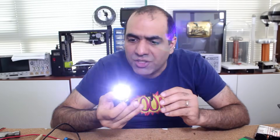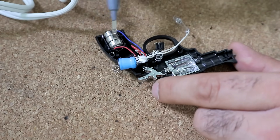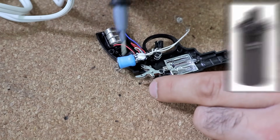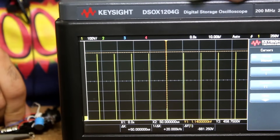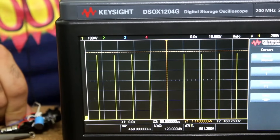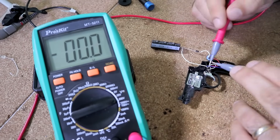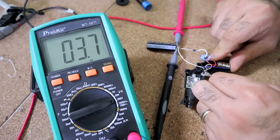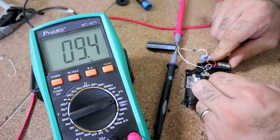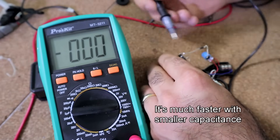This solution is too big for you? Let me show you an even smaller one. I bought this novelty gun from my local dollar store, and when you press the trigger — it zaps you! A very cool trick to end a few friendships. Here, I've opened it up. These are the batteries, and this is a tiny transformer that's like a car ignition coil, and this is the chip that turns the transformer on and off. Let's measure the output — pulses over 1.1 kilovolt happening around every 10 milliseconds. So just hook these up to the data line of your USB. I use a high voltage single diode to charge the capacitor from the output of the circuit so that the capacitor can provide the super high current. The voltage rises so slowly — this circuit really can't provide too much output current. This solution takes too long to charge. Just use the previous solutions.